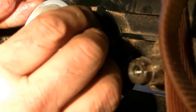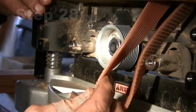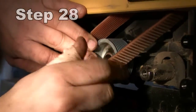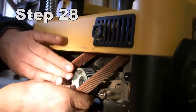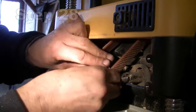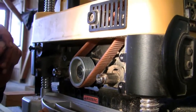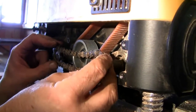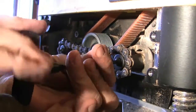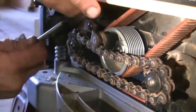Then we tippy-tap the pulley onto the shaft and on goes the nut. Next up, replace the poly V-belt. The instructions mention that at the motor end it's difficult to see when it's fully on the pulley, so take care. We just roll it onto the main pulley — always amazes me how resilient these poly V-belts are, amazingly tough and they never slip. And here comes the drive roller chain and sprocket, tensioner arm, complete with spring.